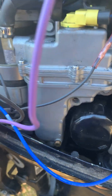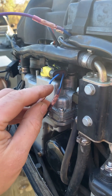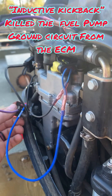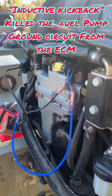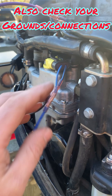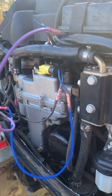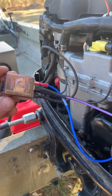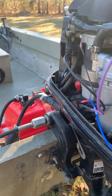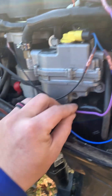Upon reading more, it's very common for this to happen when people put aftermarket fuel pumps in. I read that you could put a diode — sort of a surge protector — between the positive and negative with an aftermarket pump. But it's safe to say this aftermarket pump killed this computer. So if you put an aftermarket pump in your outboard, research what diode to put in between the positive and negative. Or if you lost your negative supply from the computer, here's an easy, cheap fix — this relay was about $27–$28.